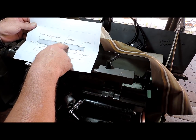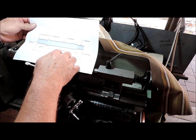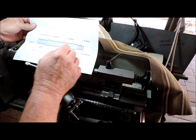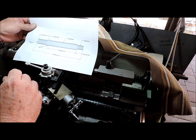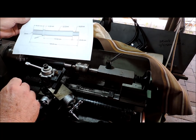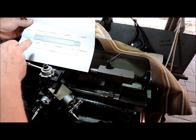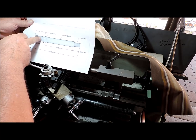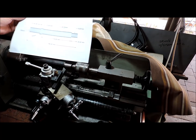It's got to be 22.278 for 115 plus the 25 — that's 140. Then I have to turn it around and machine the other end. I'll end up with a shoulder and then a keyway slot.